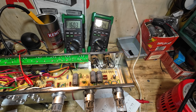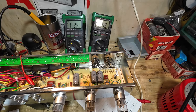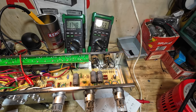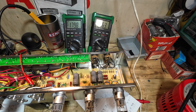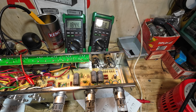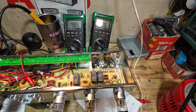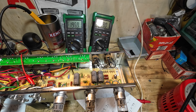Let's do the math. 1.8 divided by 44.5 is 40 milliamps, times 449 is 18 watts — really low. On the other side, 2.3 divided by 47.6 is 48 milliamps, times 449 is 21.6 watts. Those tubes are not a match — 18.6 and 21.6, that's three watts out, which is a lot.